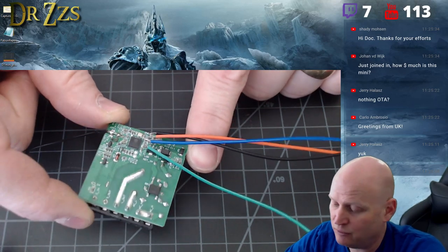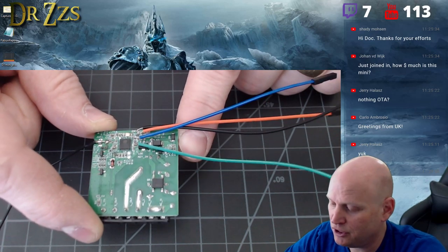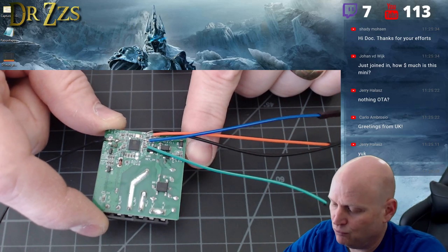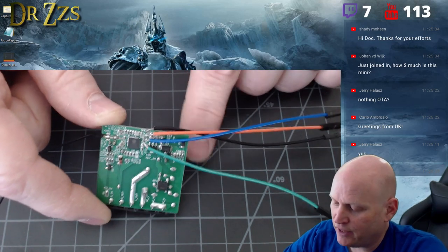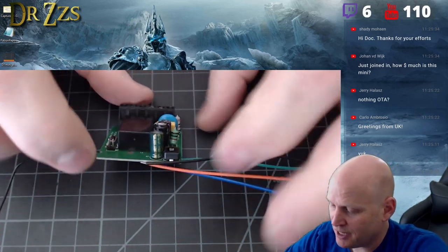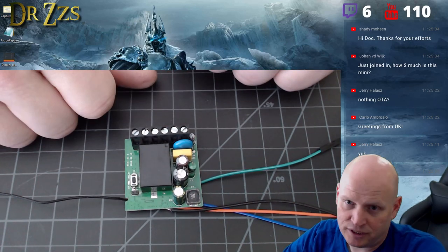You're risking a lot by sticking a soldering iron where there are that many tiny little contacts so close together — look how close you are to the chip. If you're not real steady you could ruin it. So I'm not going to recommend flashing the mini the old fashioned way unless you get in a situation like me where you brick it. Definitely, the way to do it is DIY mode.